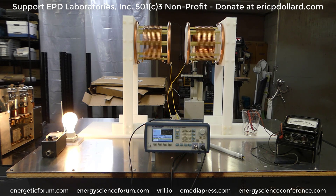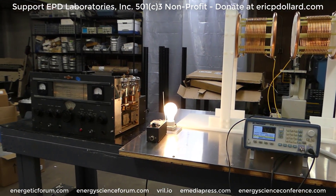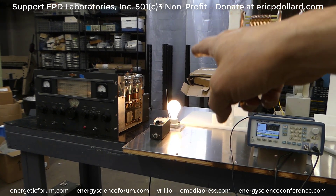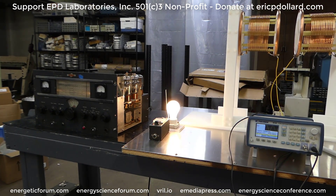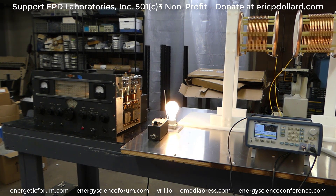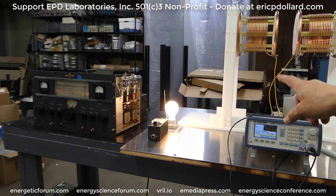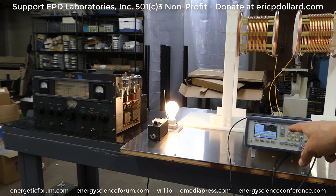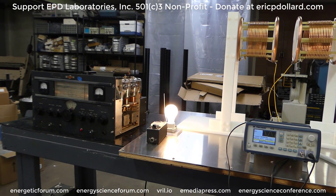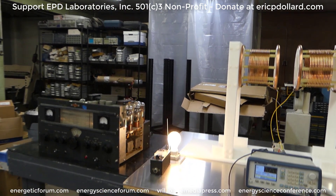What we have is the Collins, which we're using for the little flame speaker, and the output of that is hooked to that tube. We have a field strength meter right next to it. The Collins unit is tuned to the same frequency as this, or at least as close as we can approximate. I'm going to bring this camera over to this field strength meter so you can see what it's doing.